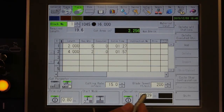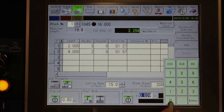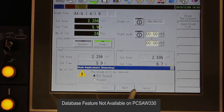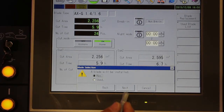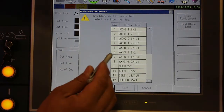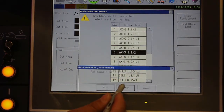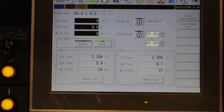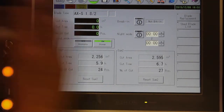To assure accuracy of the cut, you can turn on the blade deviation monitor and set the allowable limit. A blade database is also provided to help you get maximum life from the blades. When installing a new blade, you select the blade type then turn on the blade break-in function. The break-in function automatically adjusts the cutting conditions to perform the break-in and then switches to production cutting conditions.